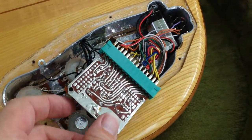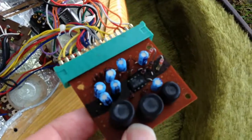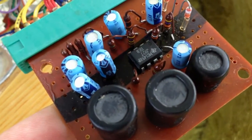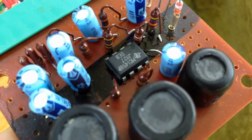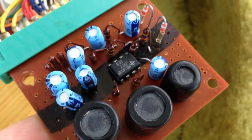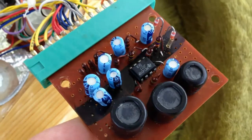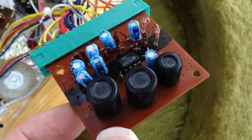I've tested this - the passive electronics all work, but this module does not work for some reason. I believe it's down to that integrated circuit right there. I've gone online and looked up the numbers, and that is a Texas Instruments MC 1458 P. I ordered some of these - pretty cheap parts - so I went ahead and ordered several of them. It looks like it might be a useful little chip to have laying around for various purposes in the future. We're going to replace that chip and see if that fixes the problem.